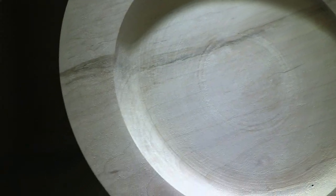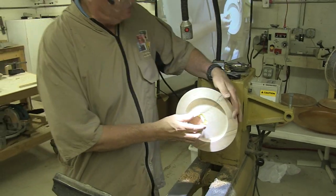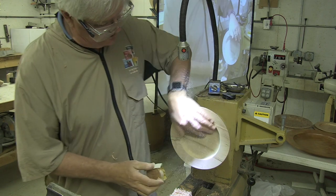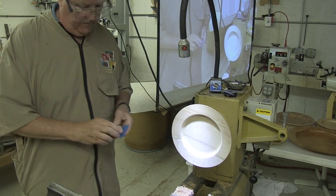Sometimes I really don't do much of any power sanding because I'm happy enough with the surface I end up with this thing here. That's 180 grit, old Norton 3X, not the new stuff they're selling now. Oops, sorry, better not put that on the internet. I like the old product better. The yellow stuff, the new stuff is blue. I don't think it holds up as well. It must be better for some purpose, but it doesn't make me as happy as the old stuff. I'm a big fan of the old version. Here's the new blue stuff.